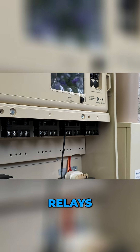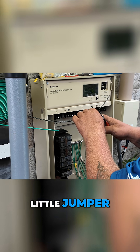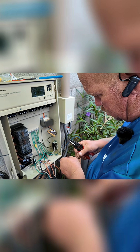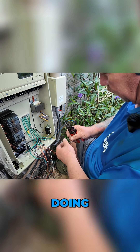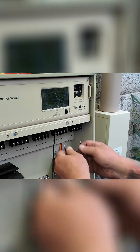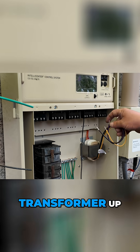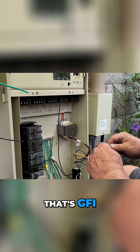So these two are going to be my light relays. We're going to make a little jumper bar — they're both GFCI. All this is doing is moving power from one relay to the next. Since this is going to be GFCI protected, I'm going to wire our transformer up into there with this, so that's GFCI protected too.